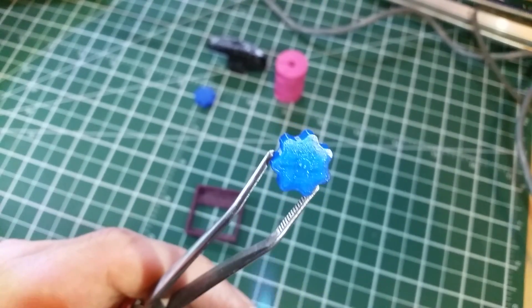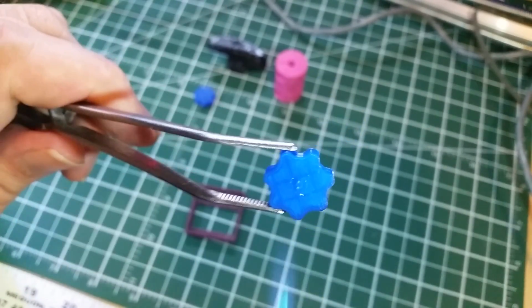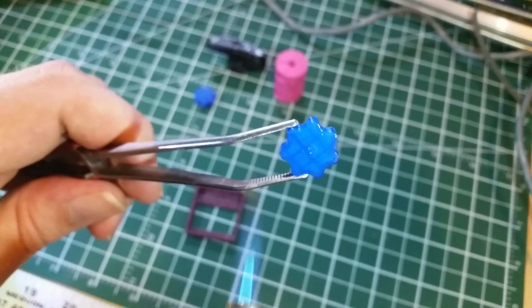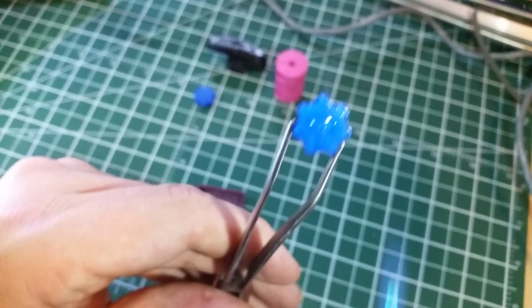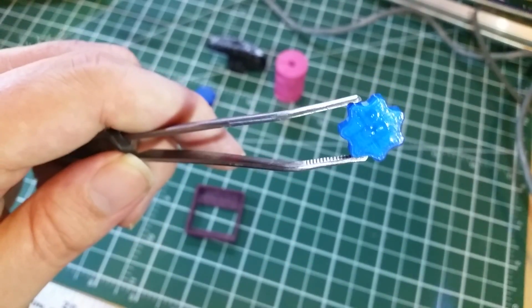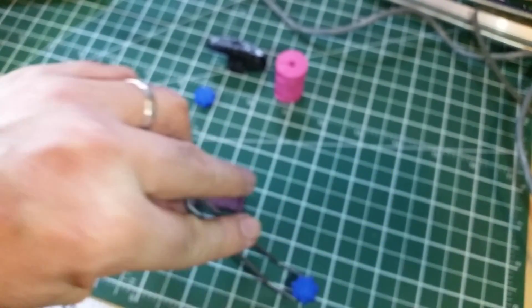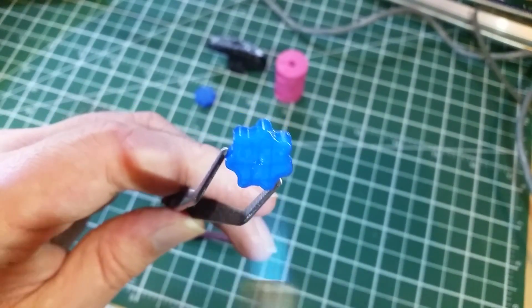It's a very hot flame, so you will begin to see the actual melt, but you gotta watch because some plastics stay wet looking once they're melting. And I've already made this one a bit too hot, if you see the bubbles. The nice thing about PLA though is you can get to it right quick. Just flatten that down on a piece of cold metal. But I did go too long on this one, so my flame might be too hot.